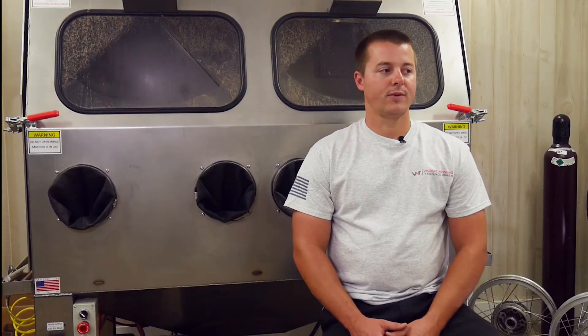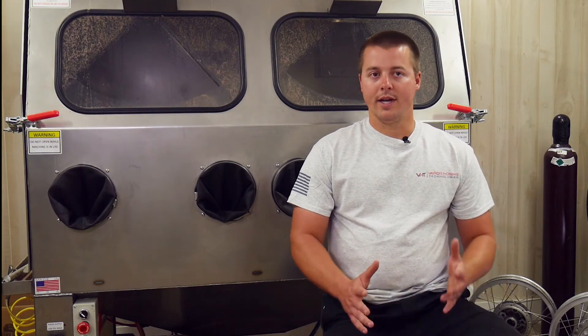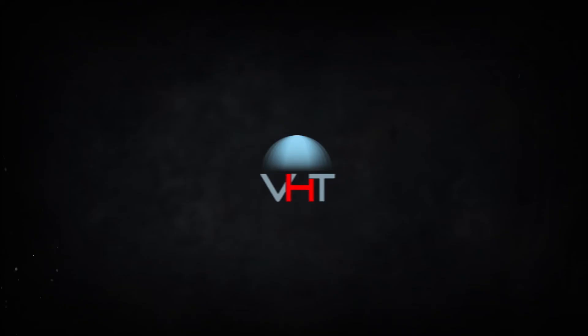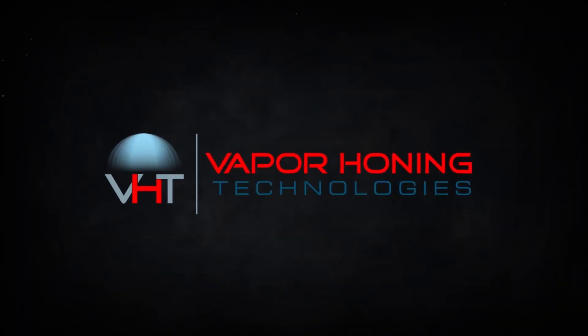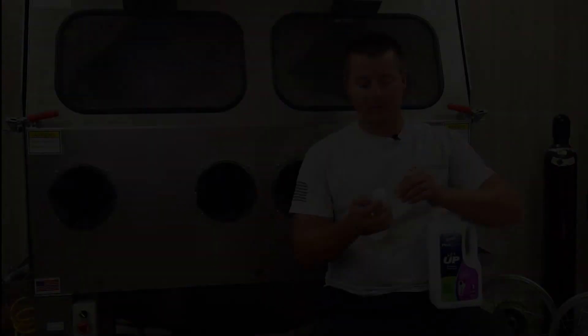Not many people experience pH issues, so it's not a very common thing. As far as water goes, you do not have an issue — you can fill it with tap water from your well or from the city, that's all fine. The biggest thing is a pH change; if pH gets up or down it will change your process, but don't worry about this. People are really afraid of what kind of water source they have, but it does not have an effect on the blasting procedure.